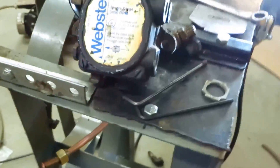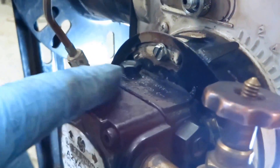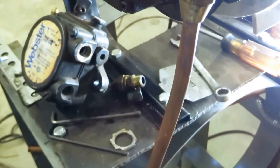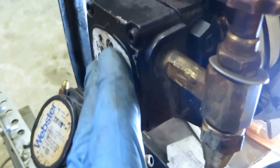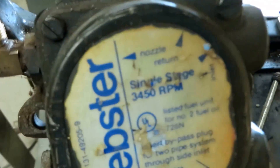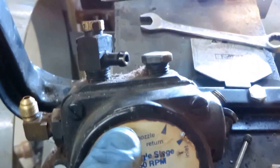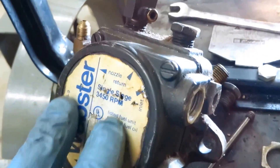I do have some two-stage SunTech pumps in the truck. This particular pump — another thing — on the inside of this pump there is a strainer. I'm going to take these four bolts out, pop this off, and there's a strainer in here. Obviously you've got a filter at the tank that catches most of the muck, and then if anything gets past that it'd get caught inside this secondary filter here. Now this is a Webster pump. They're good pumps — they pump really good, you get a lot of flow — but the only drawback to a Webster pump is there's no secondary screen.